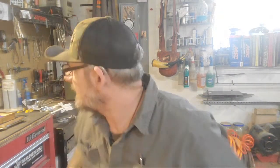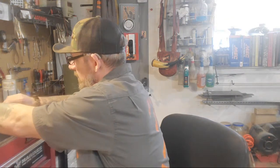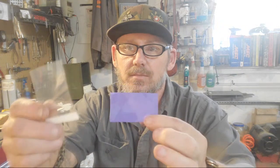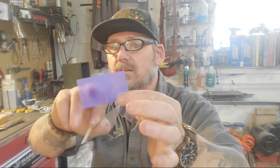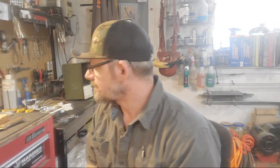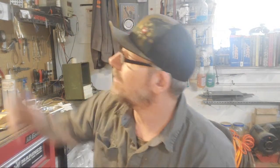You use the printed sheet as a mask over the stencil material and hit it with intense light. The mask blocks the light in that one spot — you've got to print in really high quality. Everything that wasn't covered by the mask cures, and where the mask is, the emulsion stays raw and washes away with the developing solution. I like to work under as little light as possible — usually I make my stencils at night in the shop with barely any light on, just to extend the life of my stencil material.